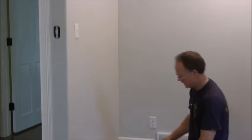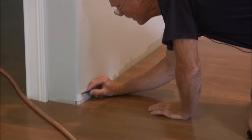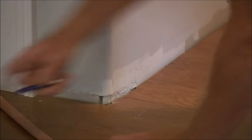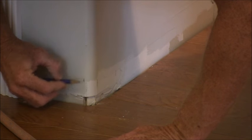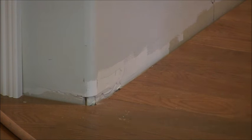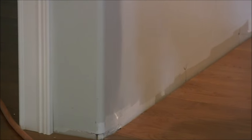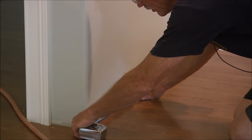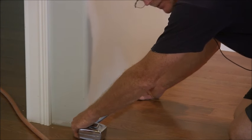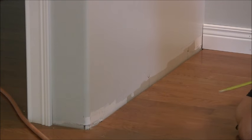I'm going to show you how to put your trim around that. Typically the way I start is — if you look at the corner, you can kind of see where the corner starts, and I'll take and make just a little line there on both sides. That's just easier to look at for me. I go about 5/16 of an inch past that line — that's what seems to work. You might have to adjust a little bit. So we're at 42 and 5/8, so we're going to go 42 and 15/16. On the other side it's 4 and 3/4, so we're going to go 5 and 1/16.